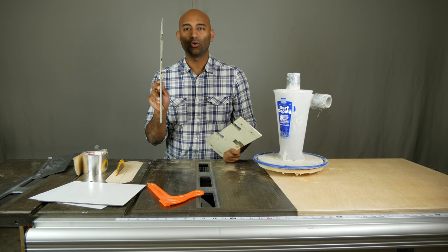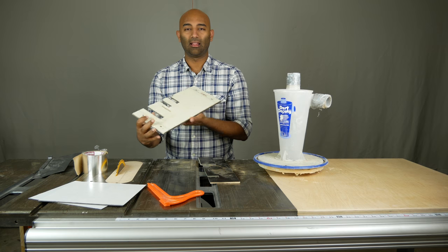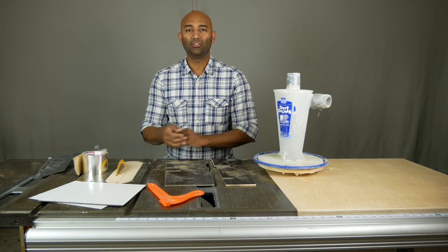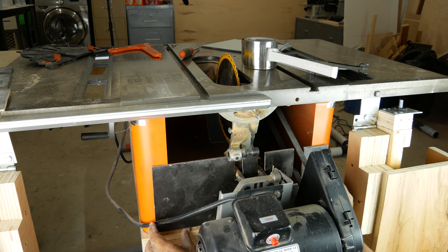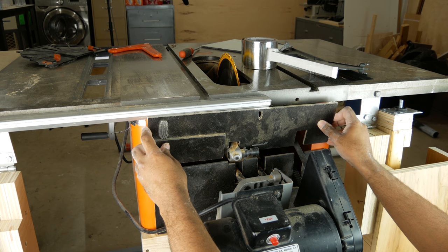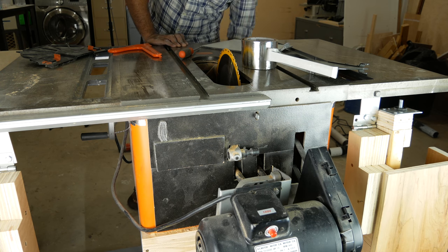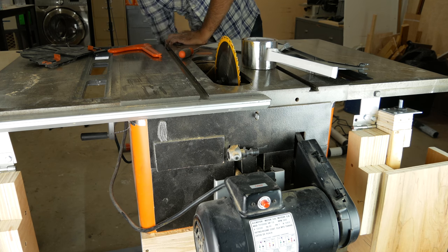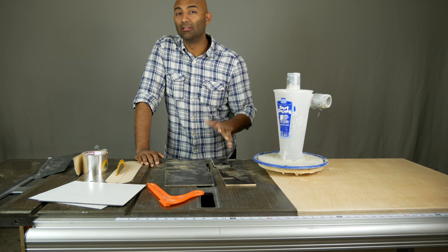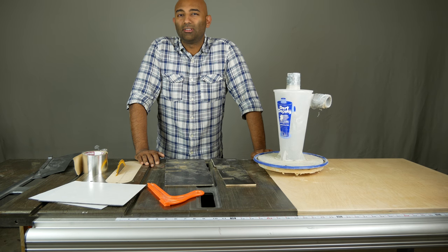This is just quarter-inch wood that I cut into this shape, and I drilled a couple of holes for the magnets that allow me to just stick it on and off from my table saw. To do that, you're going to first use a piece of cardboard — I'd recommend using thin cardboard or thick paper stock — and just start testing it out, cutting and holding it up to where you're going to mount it to check for size. The main consideration is to make sure that you can move your saw up and down and tilt it even with this blade guard on. For me, I decided I just want to be able to raise and lower it, so in the event I'm going to do a miter cut, I'll just have to take these back plates off. There would be too much opening and complexity to handle that, and because I don't do miter cuts very often, I wasn't too concerned.